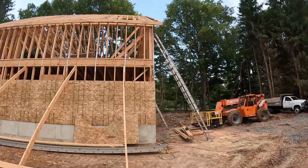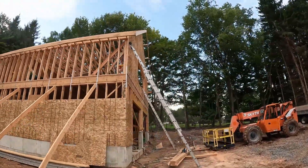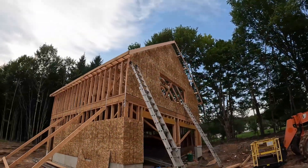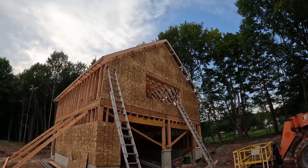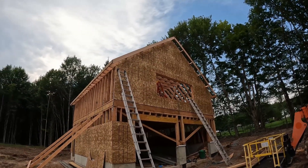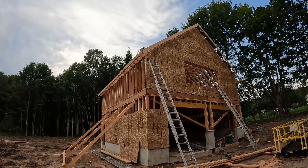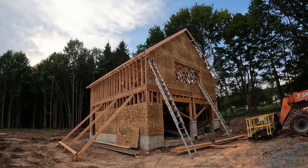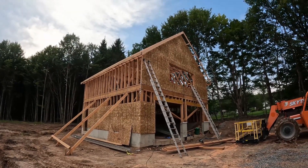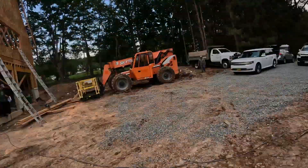The front here we just finished up last. We build these ladder pieces for the soffit on the ground and kind of just lift them up and nail them to the house — well, garage, it's not a house. It makes it much easier rather than trying to nail the little studs in and then nail the boards to them. It goes pretty easy like that. That is going to wrap it up — tomorrow we'll be back here. If you guys have any questions or comments, definitely leave them down below. Hope you guys enjoyed it. See you guys next time. Peace.